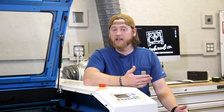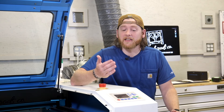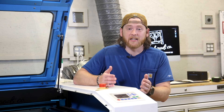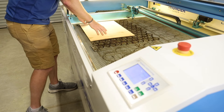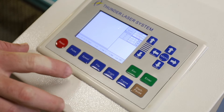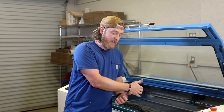We have our file drawn and our settings are the way we need them. We can send the file to the laser by just hitting the send-to-laser button — it's that simple. At the laser itself, we select our file from the menu and hit enter to select. Now our machine needs to know where our material sits in the bed. In your software you'll see a grid with select buttons — this is called your origin position. Typically in the laser and CNC world we set our origin to the bottom left of our material, which communicates to the laser where our job will start.